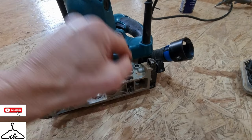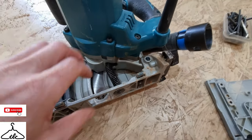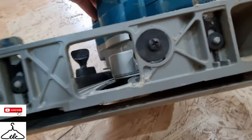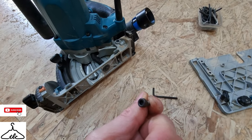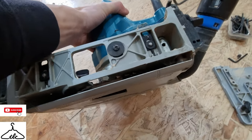We need to remove the grub screw in order to grease or lubricate the pivot pin. Now, have a look at the pivot pin — this is where it pivots, this joint here. This little round circle is the pivot pin, so we need to get some grease in that space. I've already removed the small screw — it looks like this — and used a small Allen key to take it off.